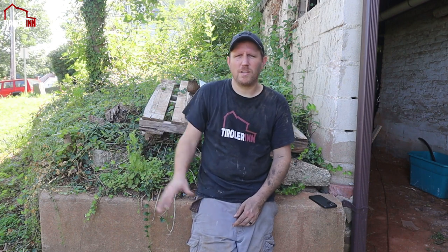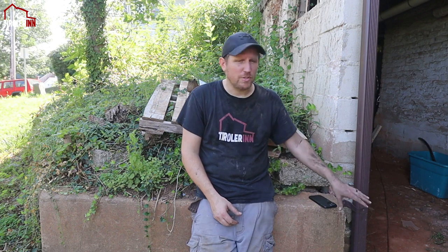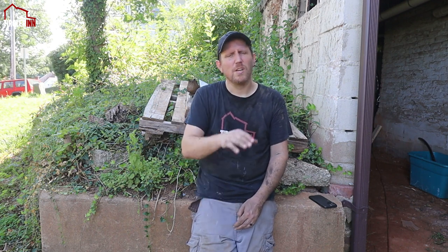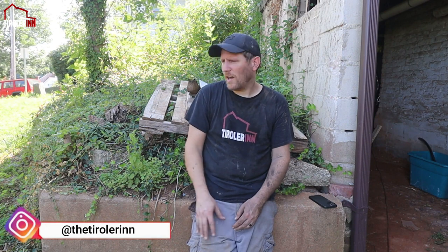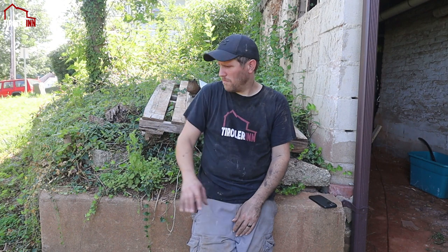But we have a lot of stuff to do. We will have an excavator here sometime soon to take out all of this pile behind me so that we can finish the wall and the French drain area. I have them marking everywhere there are utilities, the gas line, the water line, and everything running into the building. They are going to mark this week with flags or paint on the ground so that we know where we have to be careful when we start digging.